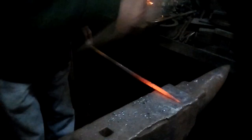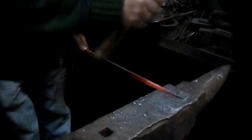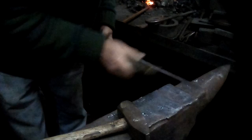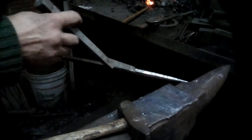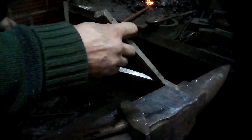What I've got here is a taper that is approximately six inches long that takes the full thickness of the bar down to about an eighth of an inch, and the full width of the bar down to about an eighth of an inch.